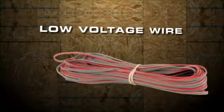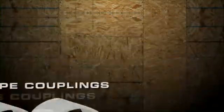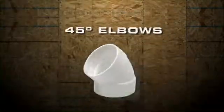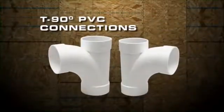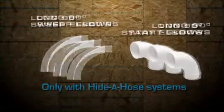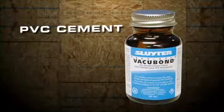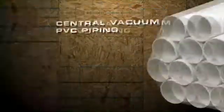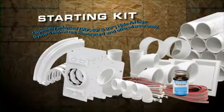It should include low voltage wire, pipe straps, pipe couplings, 90-degree short start elbows, 45-degree elbows, wire tie wraps, T 90-degree PVC connections, sweep and long 90-degree starting elbows for hide-a-hose installation, mounting plates, central vacuum inlets, PVC cement, and central vacuum PVC piping. But of course, your installation starts by a detailed analysis of your home structure and of your needs previously established with your sales representative.